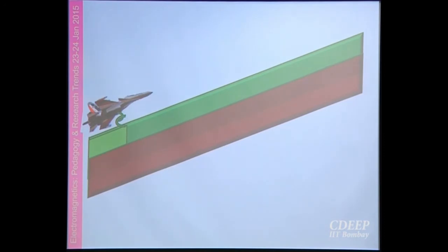An animation shows two linear motors with the shuttle — the rotor — moving between them, modular in construction. Rather than energizing the whole stator, we will energize it in parts. As the rotor moves, one part shuts down and the next is energized. The Navy's requirement is to launch an aircraft in three seconds, and then the system must be ready again with huge energy within one minute — the shuttle comes back, energy is stored, and the system resets.